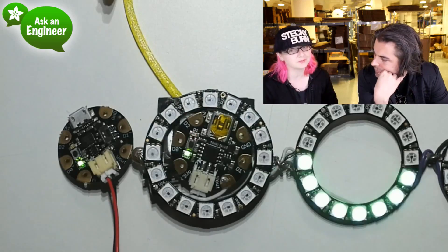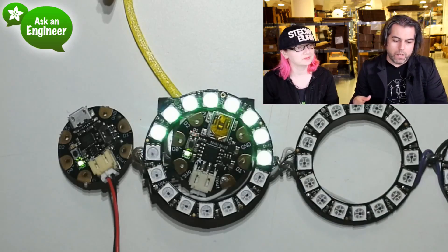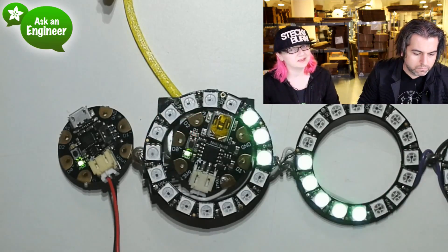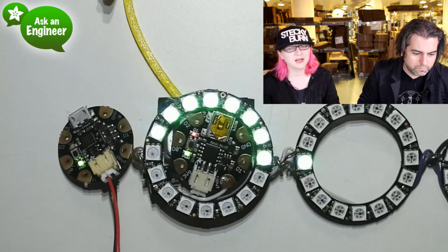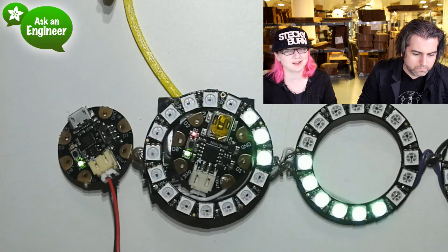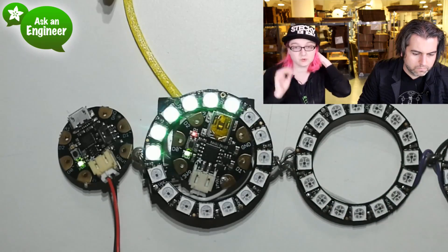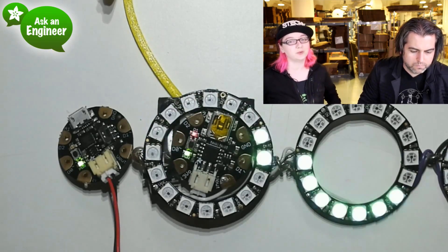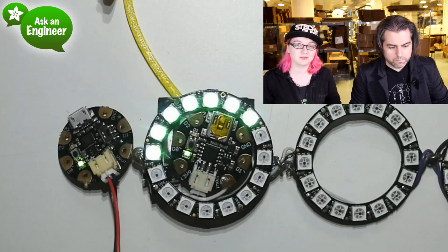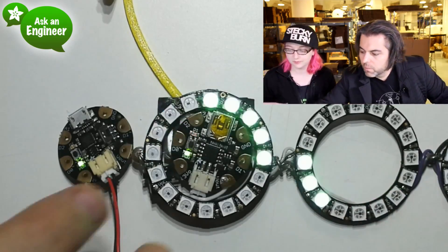And it's even the same price. The reset button is the same, the onboard LEDs are the same, the power draw is the same, the code is the same, the bootloader is the same, the Arduino IDE modification is the same — everything is the same. The Arduino language is basically C — actually C++ — but you don't really end up using objects because there's not that much space on an 8-kilobyte microcontroller. You can define functions and program the pins, and we have libraries for NeoPixels and such.